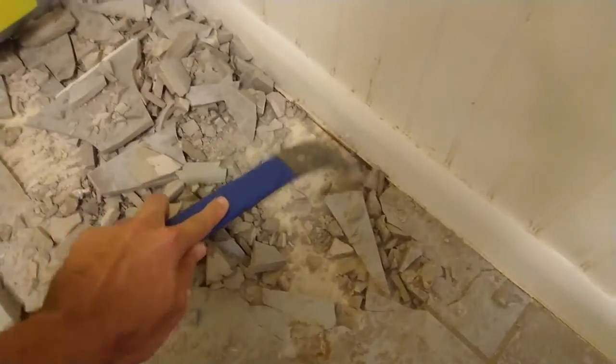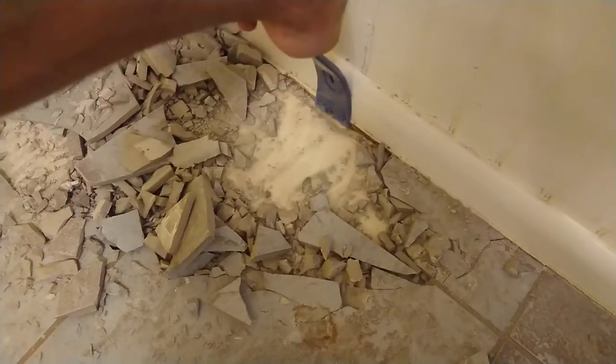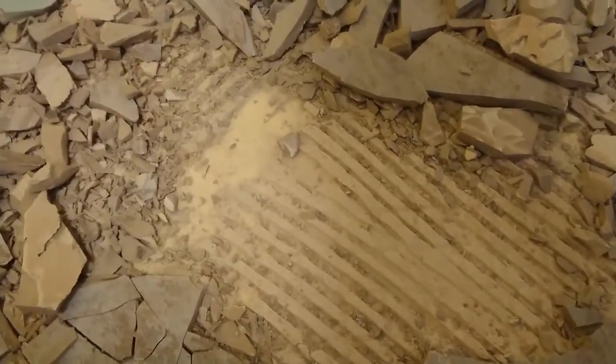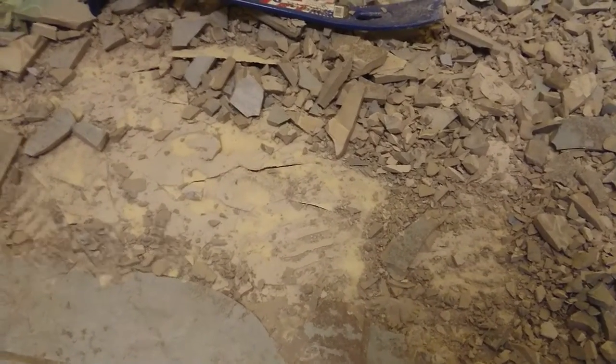In this situation, since I'm going to be removing the laminate anyway, this can just come right up cleanly. There's some glue underneath, but that's going to be the next project. Just ten minutes into the project, you can see in some areas the backing comes right off; in other areas it's still stuck to the laminate. You can see this makes a big mess — pieces flying everywhere. Keep a broom nearby, and I recommend closing off other parts of the living space because this stuff's going to get all over the place.